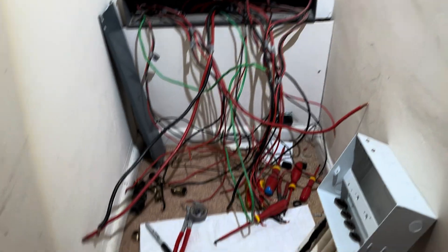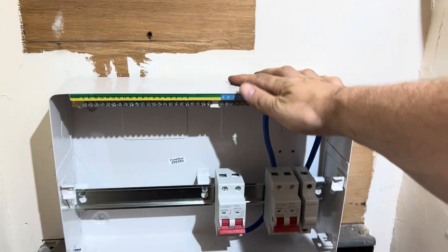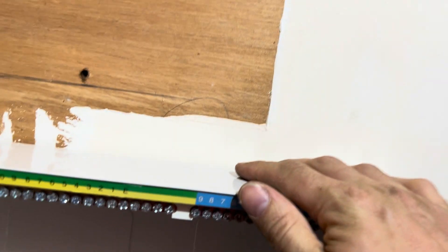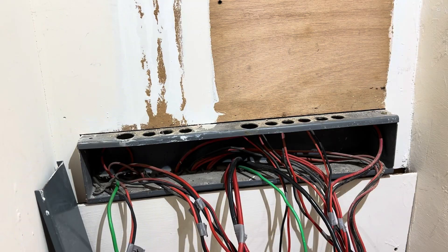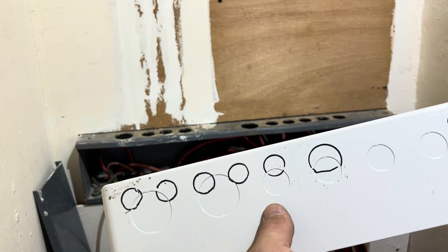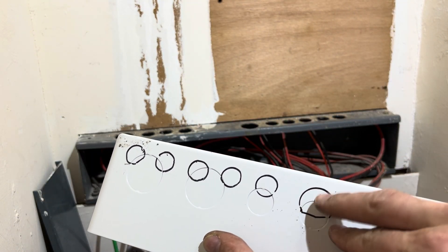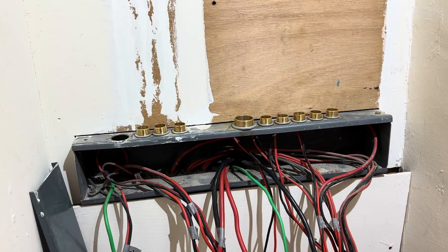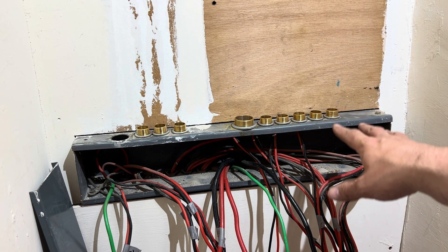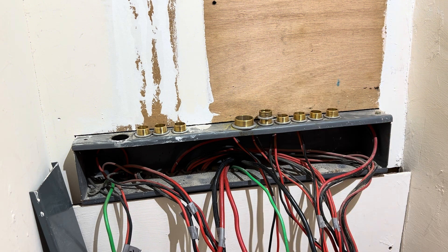It's now all stripped out. It'll take me about 10 minutes and now I'm going to get my new board cut up. I might have to re-drill the holes — I think the trunking that's exposed is not quite deep enough. I'm going to re-drill these out so they're 20mm, fill the bottom out, all the 20s, do the 32 and I'll bring all the tails in there — the four sets of on and off-peak. That's what it's going to look like and then the board's going to sit on top.